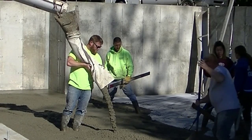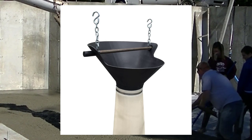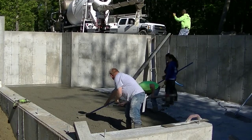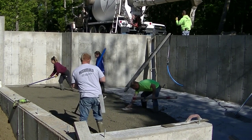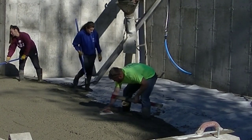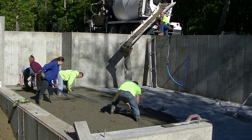We use this thing a lot — as you can tell it looks pretty old, but it makes pouring concrete floors a heck of a lot easier, especially when you're pouring right over the top of the wall like this. You can see Darren running the tremie right there — that's a really good picture of it. You can get these right on Amazon; I'll have a link in the description below. They're not very expensive — I think about $140 on Amazon, and I've had this one for years, probably 15 years.